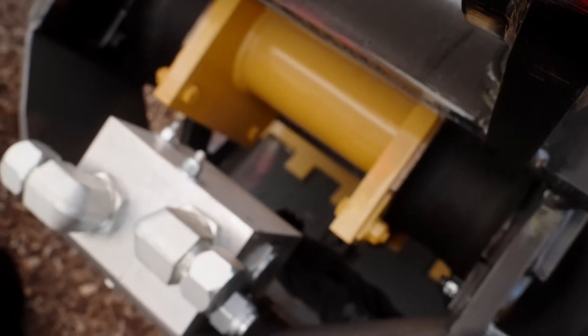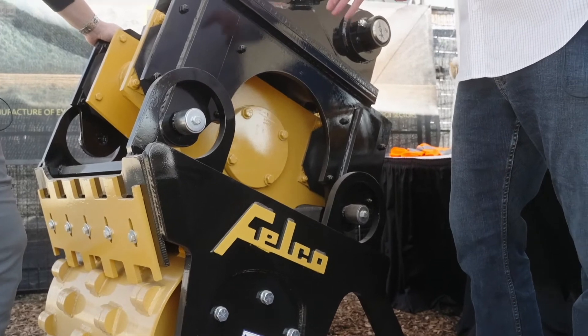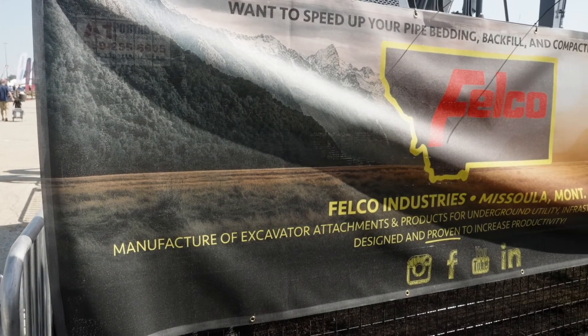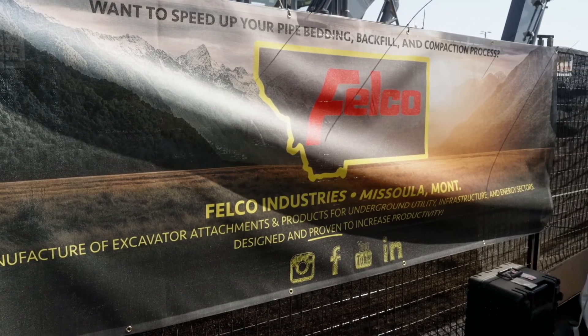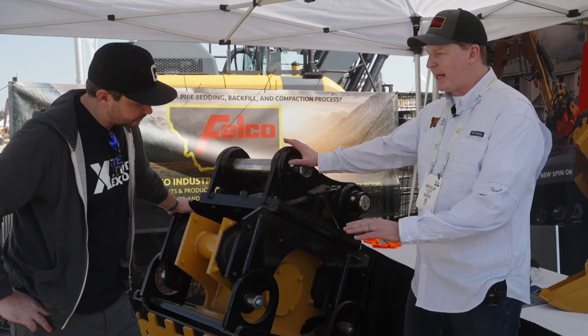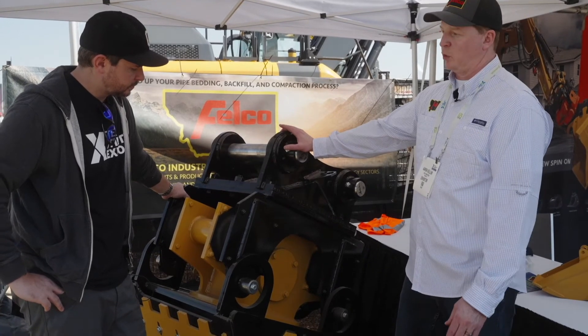We did mention that this was three-in-one: you can do static compaction, vibratory drum compaction, but then you've also got a plate on the back. When we were prototyping it, we were kind of using it as a kickstand, just to have it there so you could grab it. But then operators started using it to actually compact. And furthermore, during prototype field testing, they were running up against utility lines coming vertically up out of the soil. What they would do is tilt the plate compactor up and compact right next to that utility line — they could get into a very tight area with much lower risk than with a standard rolling operation.